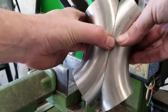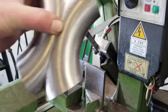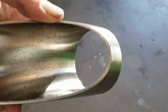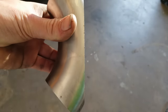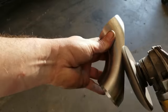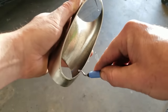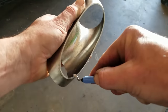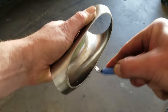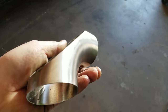As far as cleanup is concerned, we have just a little bit of a tang here left at the bottom where the metal actually breaks off rather than getting cut by the saw. The flap disc will make very light work out of it — just enough to take the burrs off. Then I'm going to go in with a deburr tool. There's a link to this down in the approved tool list in the description below, along with other tools like the flap discs, clamps, and all the rest. This is definitely an awesome tool to have for nice precision work like this.